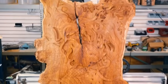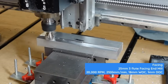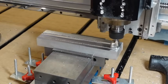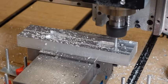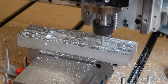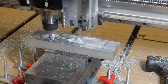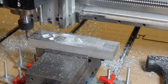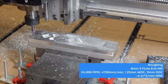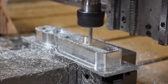Let's see what this looks like - huge, nice job sitting on top of the machine. That gives you an idea of the machine's size. Now this is what really blows me away - the aluminum work. They're surfacing at 20,000 RPM at 2,100 millimeters per minute, which is about 80 inches per minute. Now they're using a quarter-inch upcutter - you can use either an upcutter or an O-flute; you cannot cut aluminum with a down cutter. Running at 24,000 RPM and 1,500 millimeters per minute, which is about 60 to 70 inches per minute. Look at that rip around the side - 4,700 millimeters per minute, that's 180 inches per minute.